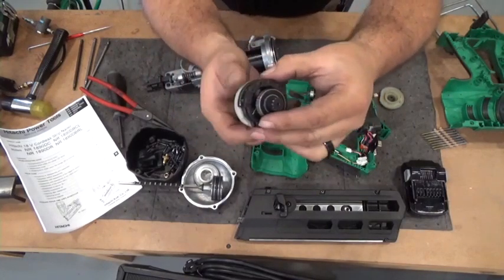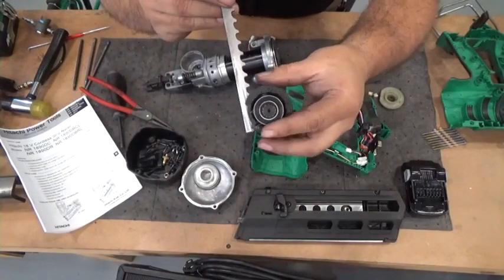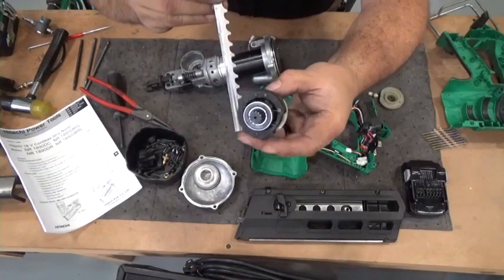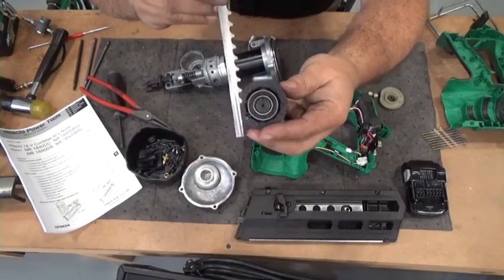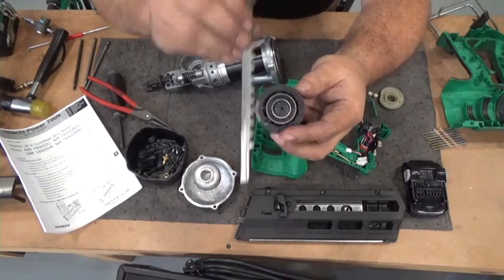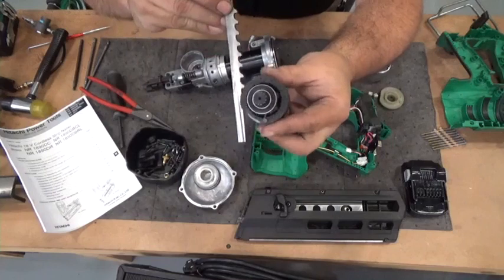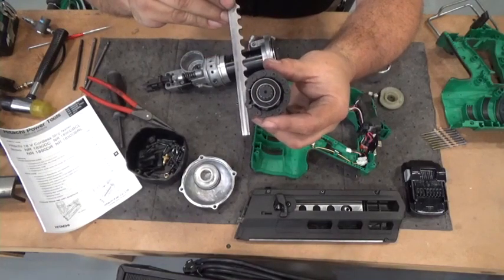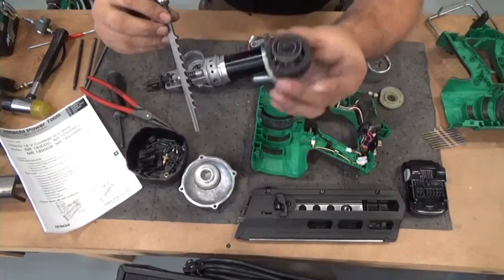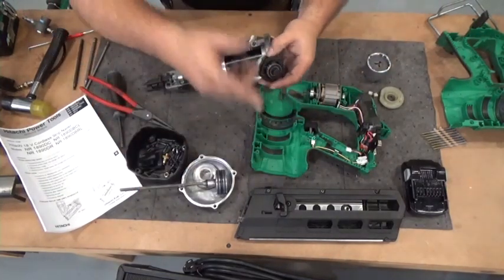And what it does is it takes those teeth, the teeth on the piston, and it runs the piston up into the compressed air. And then when it reaches this blank spot, there's no pins for the teeth to grab, and it applies your fastener. The tool continues to run in the same direction and runs the driver back up into its at-rest position. And that's how it operates. The motor is always going in the same direction. It's never going down and back up.